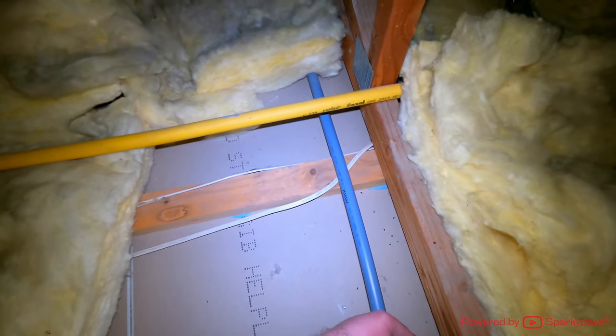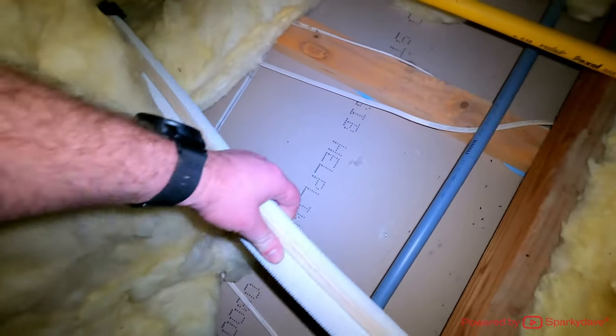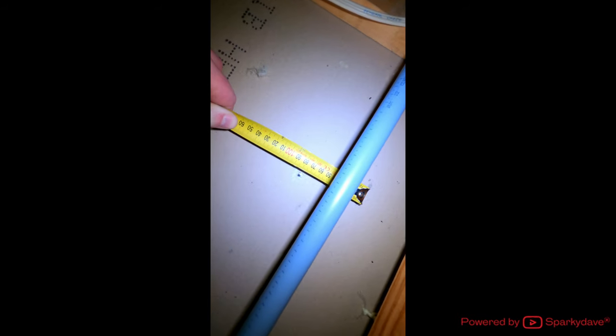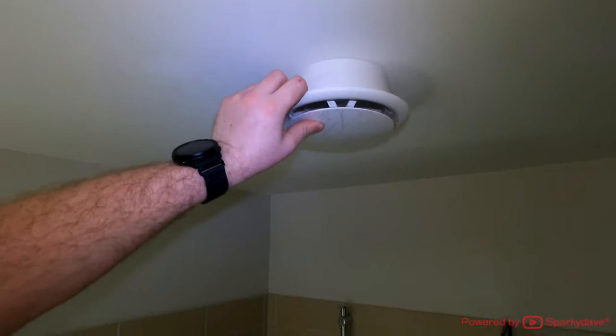As you can see up here, the screwdriver has penetrated through the plasterboard right here, near the plumbing pipe. What you've got to realize with plumbing pipes is we can't really manipulate where these are, and the ducting is going to have to go directly down onto the fitting. AC pipes we can maneuver out of the way, so they're not so bad. In this situation I'm going to maneuver the hole to the left slightly. Remember where this screwdriver penetrates the ceiling is the center point of the hole, so we've got 80mm to play with. The pipe covers from 30mm onwards - if we move it over 30mm we'll be right on the edge of the pipe. In this case I've moved the center point 40mm, so I'm completely clear of the plumbing.